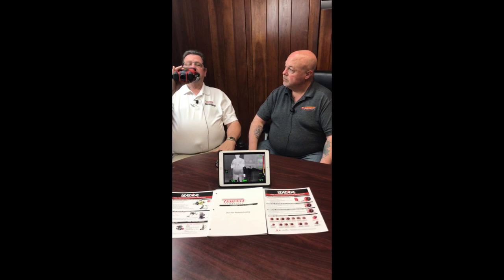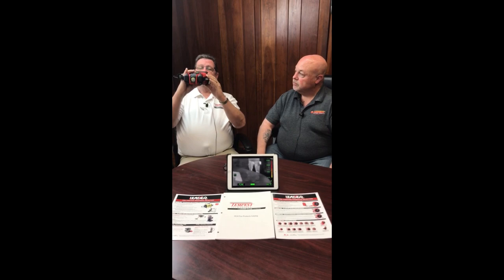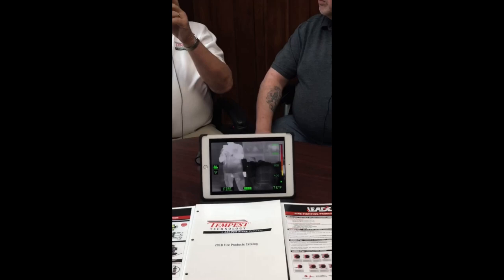The camera itself has a two thousand degree range, going from minus forty to two thousand degrees Fahrenheit, and it will change colorization modes as it progresses up into the next levels. The center button pressed and held activates video recording — you'll see a small video camera icon appear on screen. It has an eight-hour operation, continuously recording and keeping the last eight hours of video. Pressing and holding again turns off the video recording.